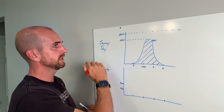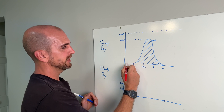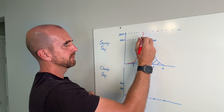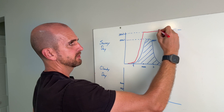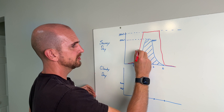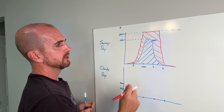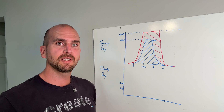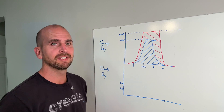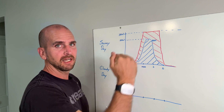Here's why having two panels and overpaneling is so beneficial. The 110 watt max was actually hit later in the day, past 3 p.m., so with two panels we start coming online at the same time, shoot up quite a bit faster, hit the 110 watt cap, travel along there longer, and then come back down. We'd have all this additional area underneath the curve to fill up the batteries. The power station itself is clipping that extra current and bringing in only what it can consume, which is why we get a bigger portion of the day maxing out the solar input.